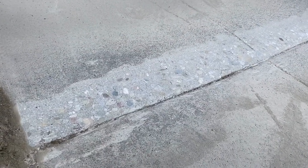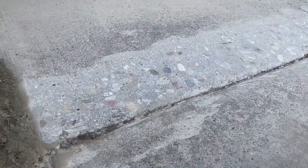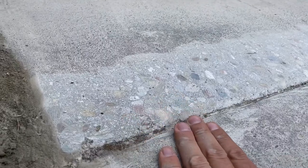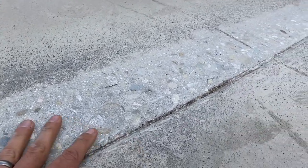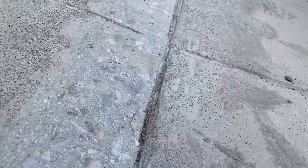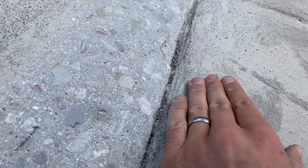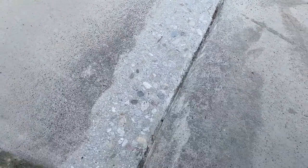Here's the final product: 61 inches across with about three-eighths to a half inch shaved off the sidewalk. It's got a nice finish — less than a quarter inch gap, nothing right there. It looks really nice with a great polish on top, matching the final finish of the section on the right. That's the Milwaukee M18 hand grinder, battery operated.